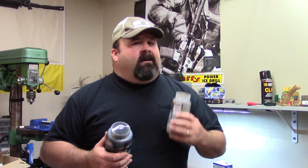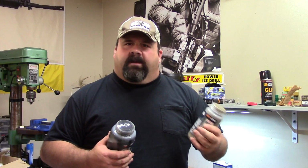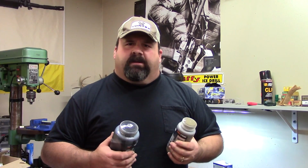Acetone to clean everything up real well. Preheat, acetone, preheat. The main thing is getting the materials that you're going to be Cerakoting extra super clean. That's right, guys. Acetone works well. I think carb cleaner, brake cleaner, that kind of thing works pretty good too.